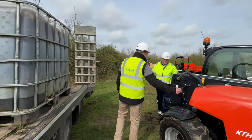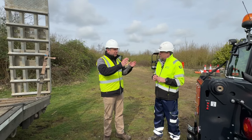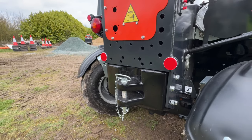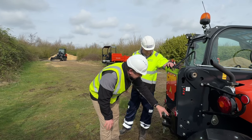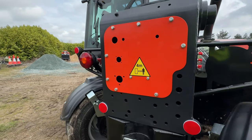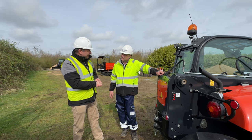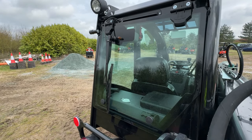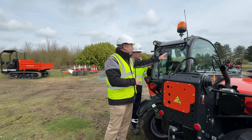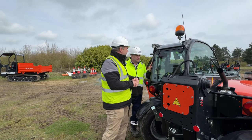Let's talk about the back end — the counterweight. So I talked about the lightweight and the heavyweight. To make it into a heavyweight and get the increased lifting capacity on the front, we have this heavy 170-kilogram block here with an integrated tow pin. As you can see on the side, it's just bolted on here. The lightweight version still has the tow pin, but just with a plate with the integrated tow pin on it. This additional 170-kilogram block gives more counterweight on the back end to balance the machine, increasing the transport weight by an additional 170 kilograms. You've got a windscreen wiper on the rear — what I like about it is that it parks in a vertical position. Why do wiper blades always park in the horizontal position? All the dirt sits on the top, and on the return wipe you skew the dirt and scratch the paintwork.